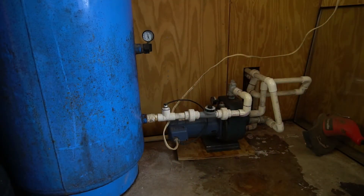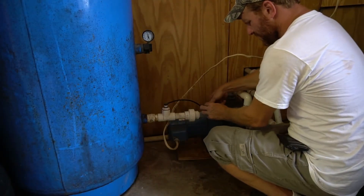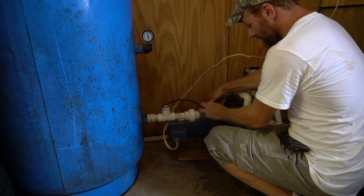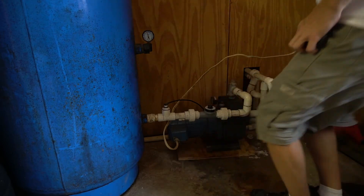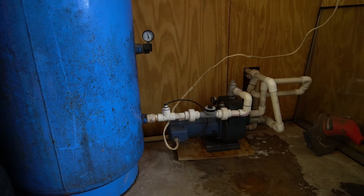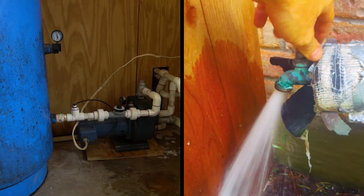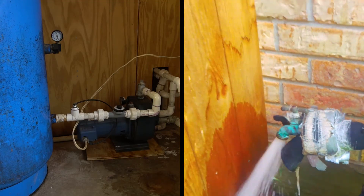Now that it's all fixed, we've got the aerator working. I'll adjust it a little bit here — put it on 45 degrees. I'm going to go outside and run the pump and see how long it takes to come on, now that it's starting out with a little air charge. Let's open the faucet here — I'm going to open it all the way.